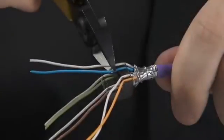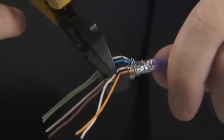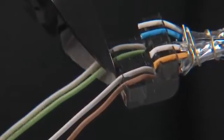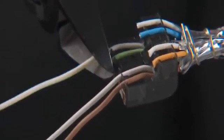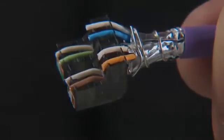Now using a pair of small wire cutters, trim off the ends of the wires. The end of the wires on the upper layer of the block can be trimmed as much as 3mm from the edge. For the pairs on the lower layer, trim off approximately 0.5 to 1mm from the edge. For best results, do not trim flush with the edge of the block.